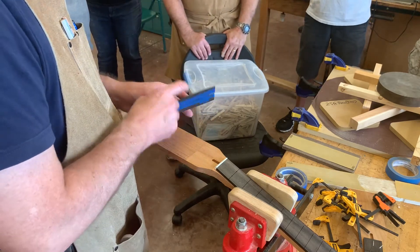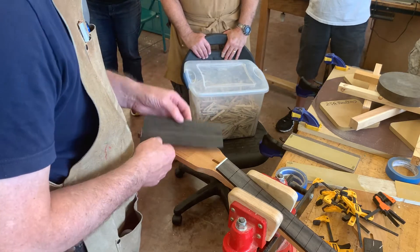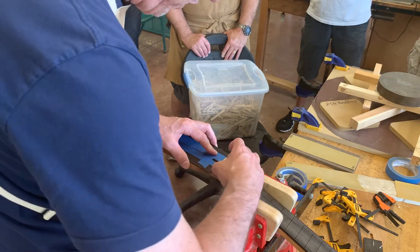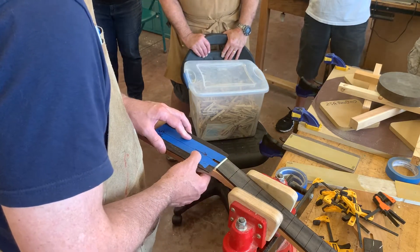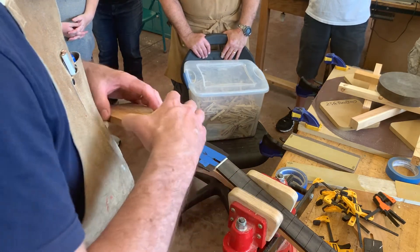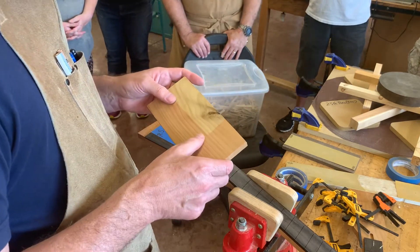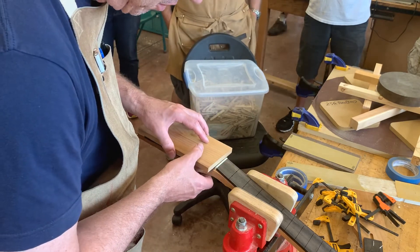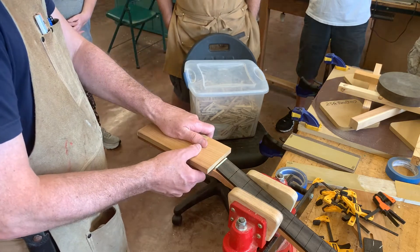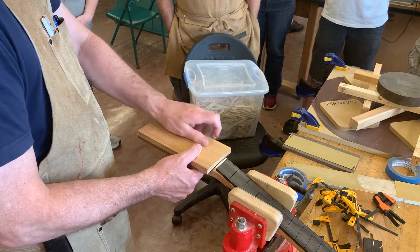This is water-based glue, so when you put the glue on here, this side is going to try to expand more and the whole thing is going to cup a little bit. That won't stay that way, but when we glue this on we've got to make sure it doesn't move and that it's held flush everywhere. This thing is called a clamping caul — what it does is distribute load, so I put it on there, mash everything flat, make sure nothing's going to move, then put the clamps on.